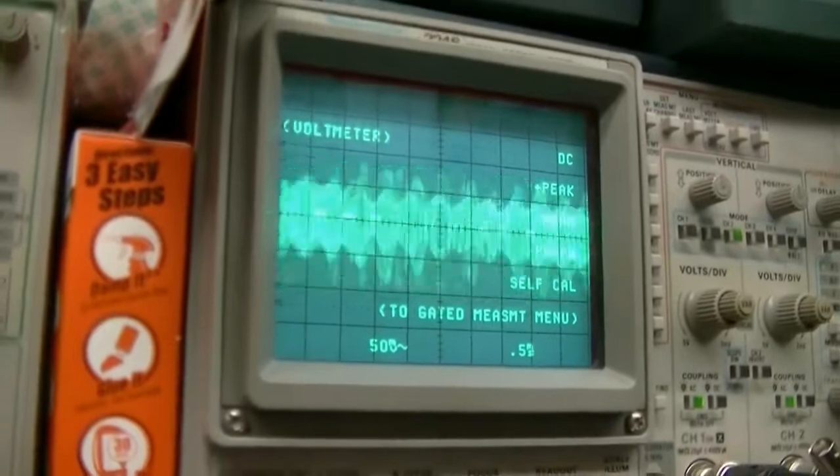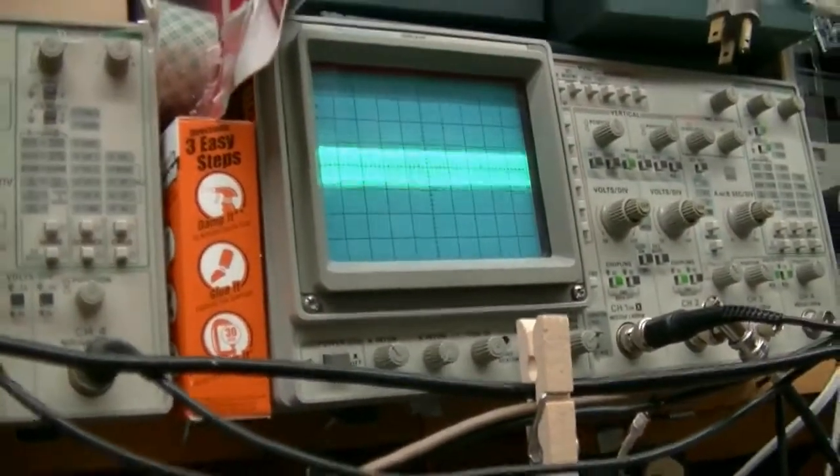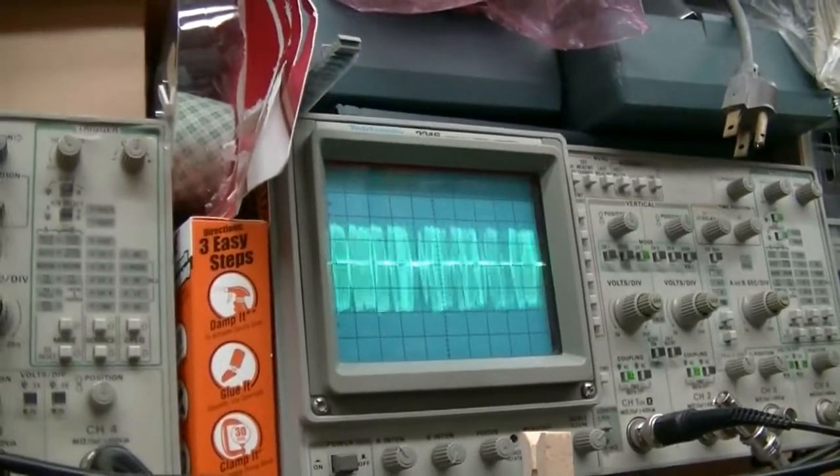Just remember that in order for you to hear things come out of the speaker, the microphone has to be plugged in. We're using the microphone to switch transmit and receive because we changed from a five pin to a four pin. I did not put a relay inside the radio — you don't have room for a relay inside your radio, it's full. Let's do some modulation checks. Here is the modulation on scope. Audio, hello, one, two, three, four, five. You can see your microphone will overdrive the radio, so just turn your mic gain down a little bit. Turn it down to about 12 o'clock — looks pretty good. That was on AM.